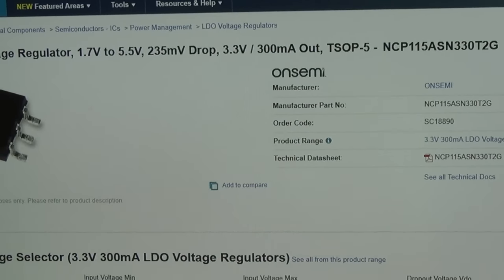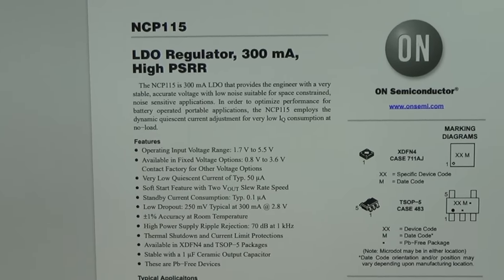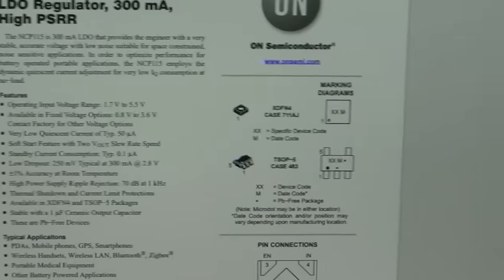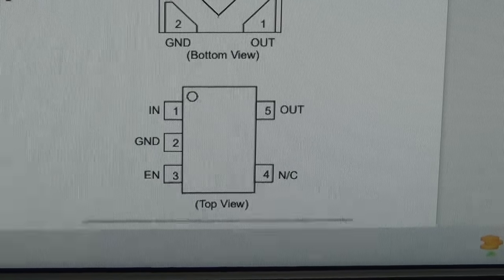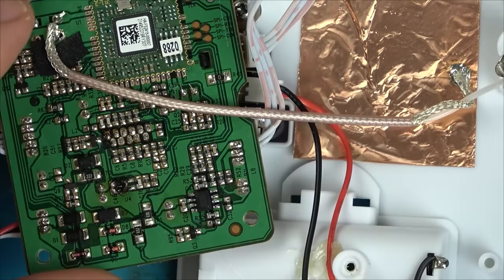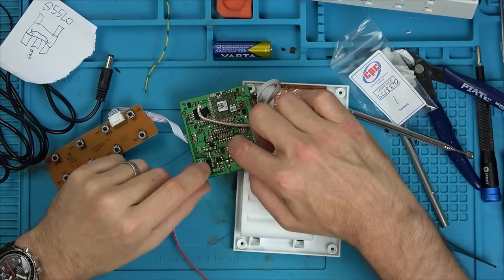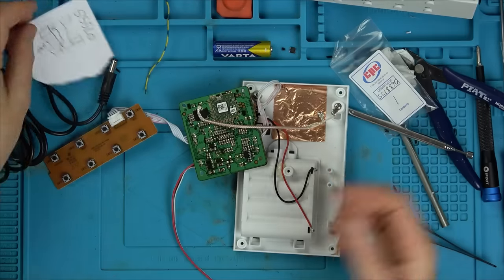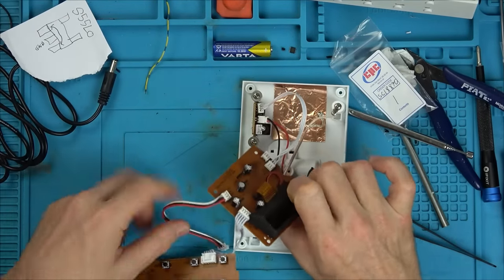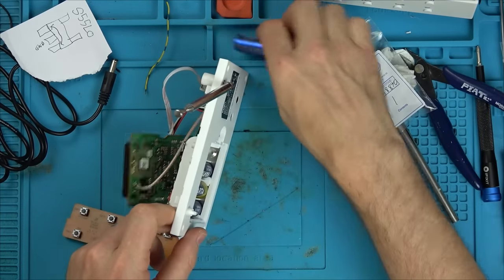This is the next one I'm going to try. I've only got one of these — it's an LDO regulator, 300mA, high PSRR, and it has an 'enable' pin. Pinout: in, ground, enable, out, and not connected. That's soldered in now. I'm wondering whether the output feedback needs to be on a different pin. There it goes. Anything? Oh — yes!